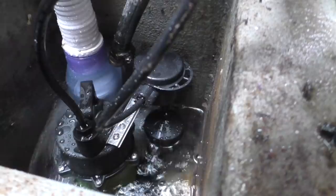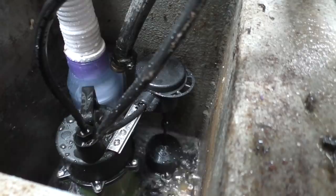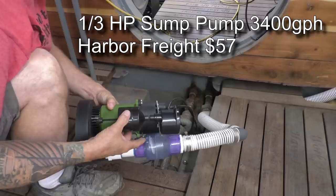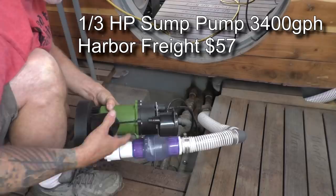That's a really good float switch system. The ones that swing freely on the wire get jammed up a lot. The float switches on these are fixed on a rod — as the float rises, it pushes the rod and turns the pump on. As the water level goes back down, the weight of the float switch pulls it down and the pump turns off.